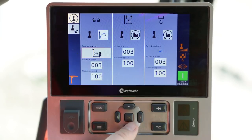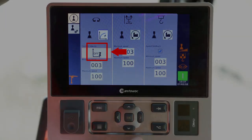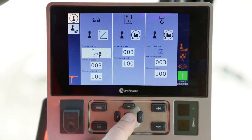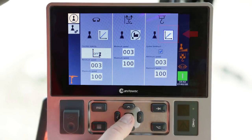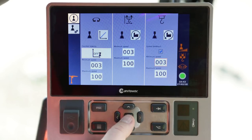For the slewing movement, you can activate Counterslewing and select the Counterslewing type. For trolleying, select the Driving Profile most suited. For hoisting, select the Driving Profile most suited. The Speed Feedback function makes the right-hand joystick vibrate during hoisting and lowering movements at low speed. The frequency of the vibrations is proportional to the speed of movement. This function acts as an aid for precision and gives the crane operator a better feel for the movement at very low speeds.